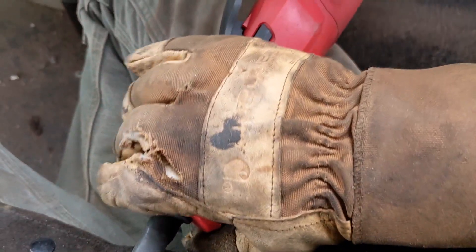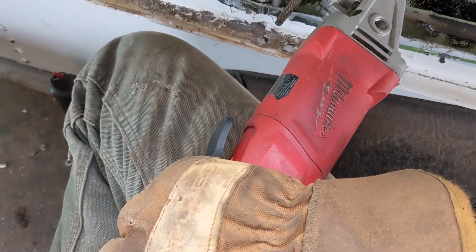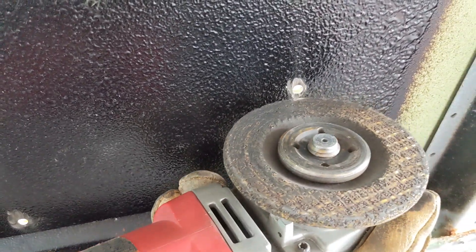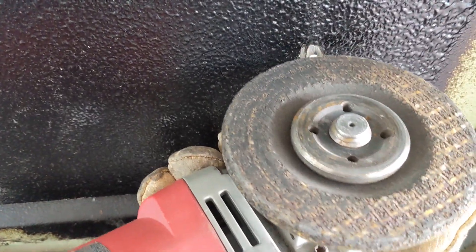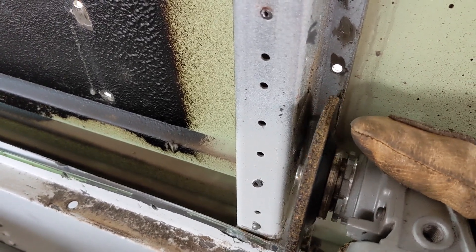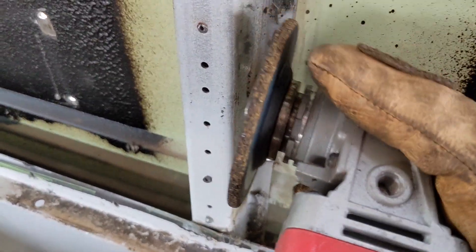With my other hand I hold the grinder close to my body — I tend to sit down and snug it right up into my belly, hold the other end, and rock it back and forth. If I'm cutting a rivet I use a little wrist action on one end to rotate it up and down and cut the head off, and vertically I move it side to side, always keeping in mind that I want to stay clear of the path of the blade if it were to catch and jump.